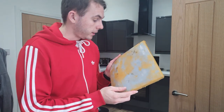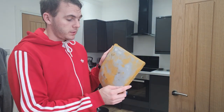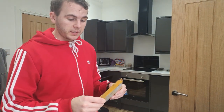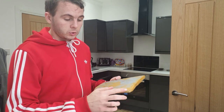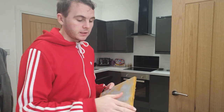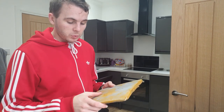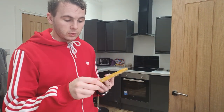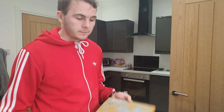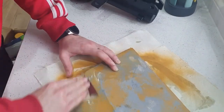Moving on to the part we were talking about last time I was filming — I've put the resin on and it's pretty solid, next to no flex left in it, exactly what you want. I've layered a wee bit along the front just to fill all the pitting, so I'm going to come in and sand that with 600 grit, bring it smooth again. There are a couple of wee spots where I've sat it down, so I'll sand it all smooth and then review — I can already see a few spots so I can tell you right now we're going to be using a bit of filler.